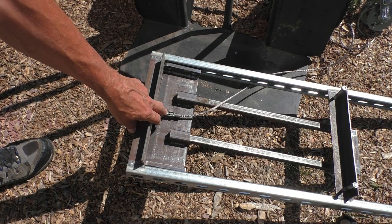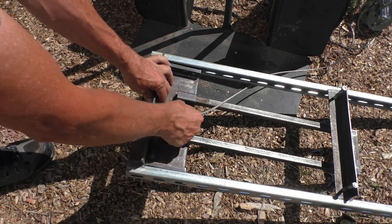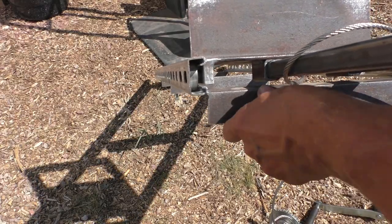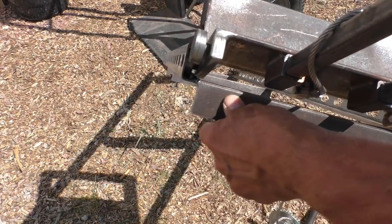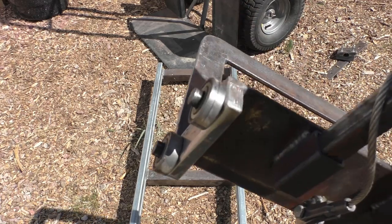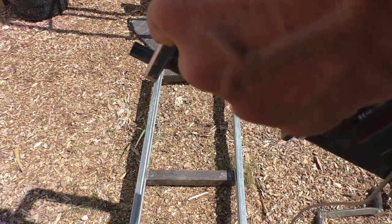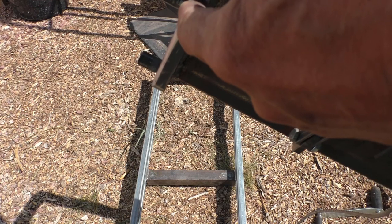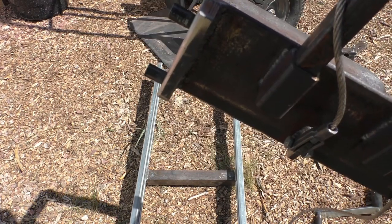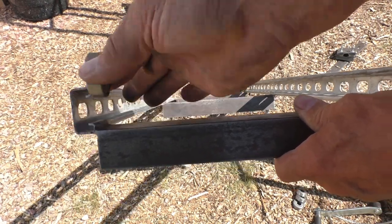At the bottom of the cable I put on a rod clevis, and it just has a single piece of bar welded on there for the cable to attach to it. Those are the bearings on those pins — it's like a half inch bar with a couple of cap screws. The bar was threaded and then these were just screwed in with the heads cut off. The bearings were a pretty decent fit for inside that channel — there's a little bit of play in them but not much, and that handles all the load.